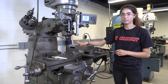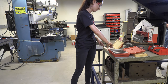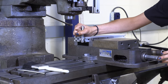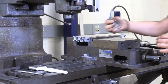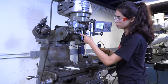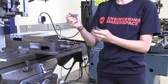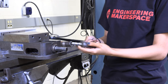After our piece is secure, we're going to find an end mill — those are located next to our parallels. Today I'm going to be using the half-inch end mill. When picking an end mill, you want to make sure the cutting edge is longer than the piece of material. The next step is finding the corresponding collet — those are on the side of the machine. I'm grabbing the half-inch collet because this is a half-inch shank, so it fits directly in.